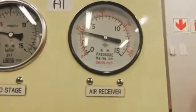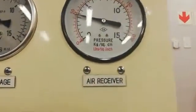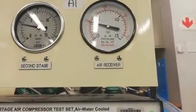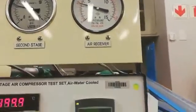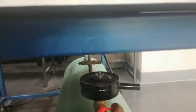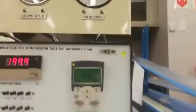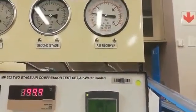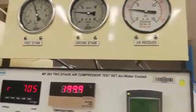Say you are given three kilograms per square centimeter to run it. To maintain that pressure at three kilograms per square centimeter, you need to play around with your air receiver valve — open it a little bit. Once it's constant at that pressure, you start taking your readings.